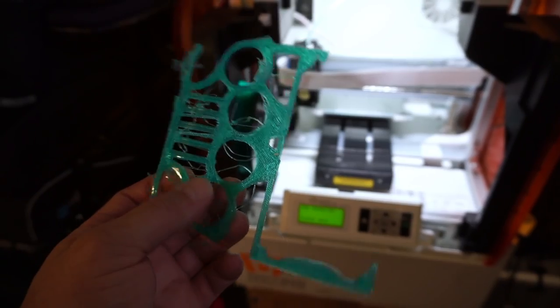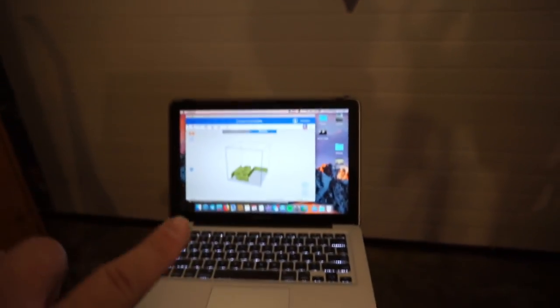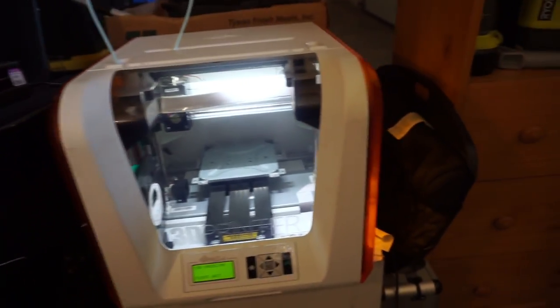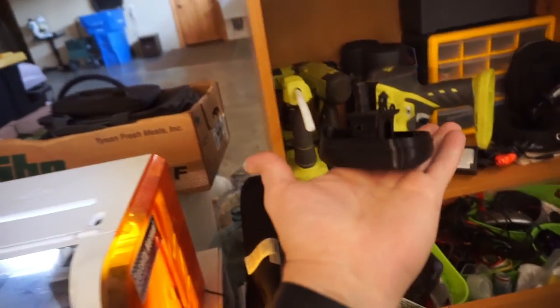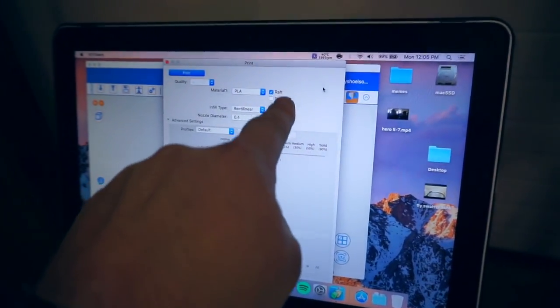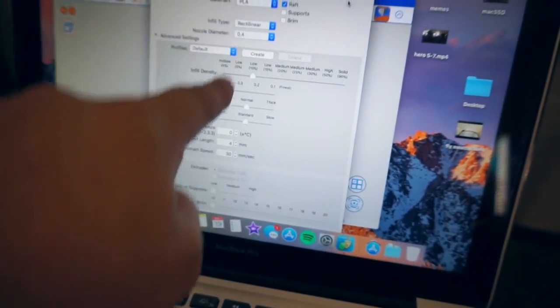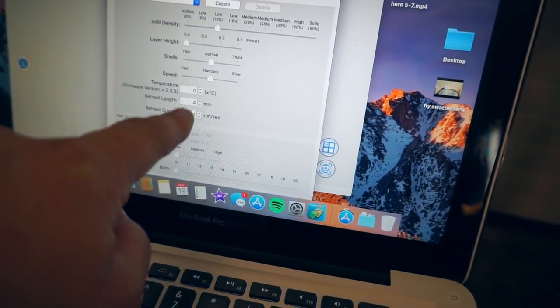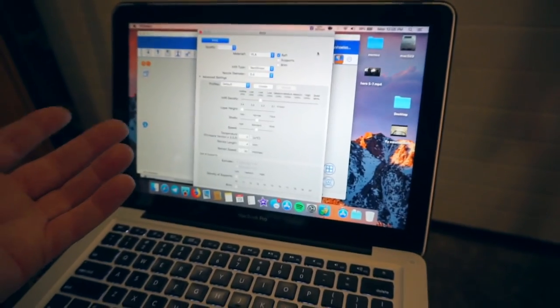Plan D, E, or F is going to be putting some tape back on there, using a glue stick, and potentially printing with a raft. Actually, I think I'm going to try a raft right now — I've never done rafts with this machine, and you're probably wondering what the heck I'm talking about. When I say raft, I'm not talking about something that floats. Let me get it set up and I'll show you. We have selected raft — rectilinear infill, nozzle diameter 0.4 millimeters, 10% infill, layer height 0.4 which is the size of the nozzle, normal shells. I've slowed it down to standard instead of fast, because when the head's moving around sometimes it'll knock the part loose. It's not letting me change the density. Density of supports — raft. Okay, so I guess the raft is just going to do what it's going to do and I can't change it.